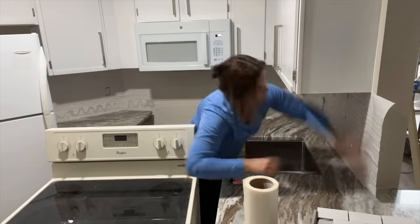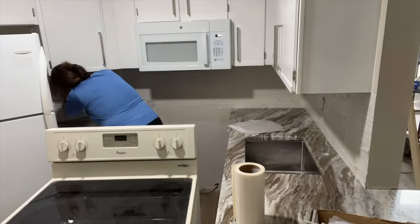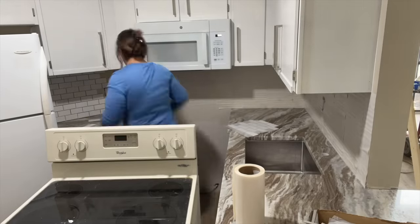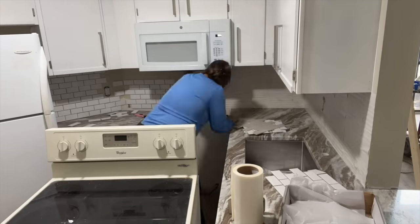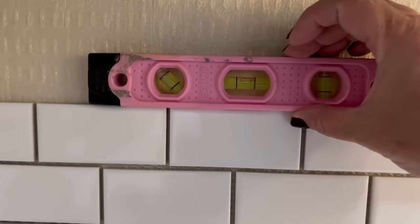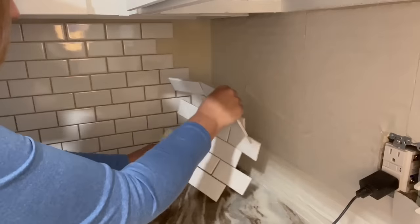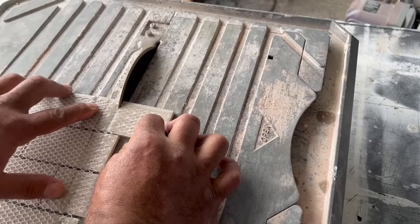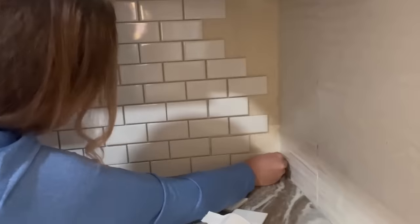When I was ready to place the tile, I removed the white cover sheet. My tiles were 12 inches and the mat is 12 inches, but I removed two cover sheets at a time to have a larger sticky surface area and avoid risk of pulling up a tile when removing the next adhesive sheet. You can use spacers when installing the tile sheets, but I felt comfortable working without them. The work progressed pretty easily, and I was lucky that at the first corner the tiles ended in just the right spot.